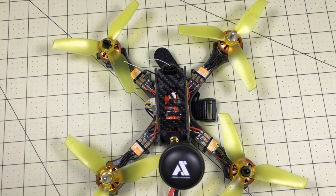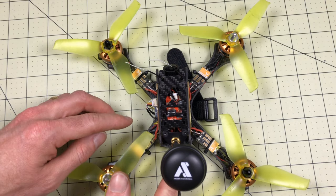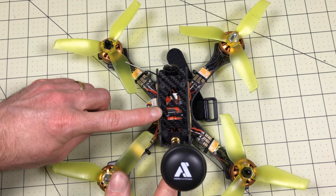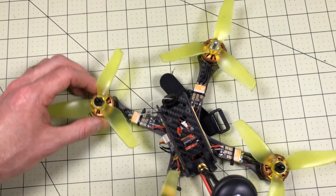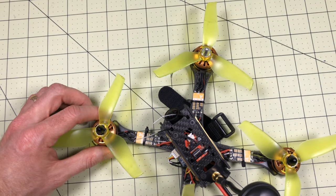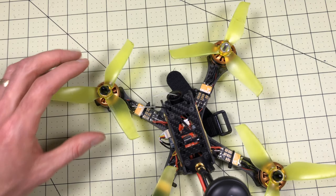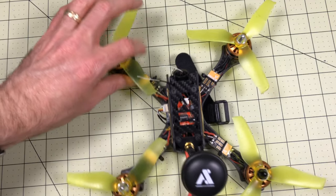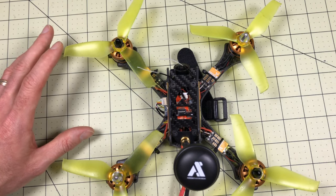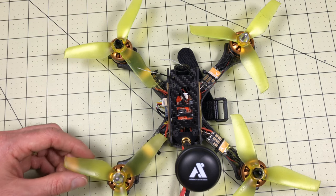Just a quick summary of what I did: I added a buzzer, which is essential if you do lose it - and the way I throw this thing around, I do occasionally. I added telemetry on the receiver, which makes it beep at me and drives me crazy, but at least makes it so I don't ruin my battery, which I would have on those last couple packs. And a GoPro lens - that one was the trick for me. It has to be an IR block lens, because you saw what happened when I put in a non IR block lens - it was terrible. You can just replace the whole camera and spend about $30 to $40 - a Runcam Swift 2 would be awesome because then you could add OSD also, but I didn't want to do that.